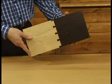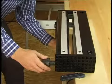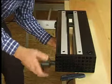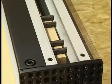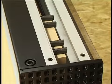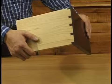End-to-end dovetails are a decorative method of joining boards together. Machine as for lap dovetails, except both parts are clamped vertically against the rear channel. Use the tail guides to cut the tails and the lapped pin guides to cut the pins. They can also be used as a quick way of determining the correct depth of cut for lap dovetails.